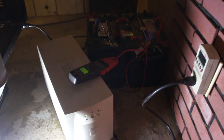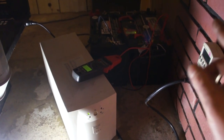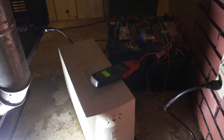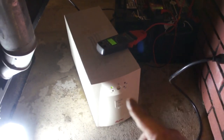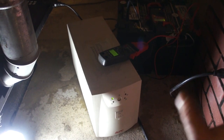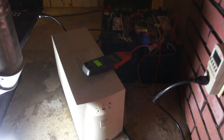That's inefficiency. The reason I like this UPS unit is it's efficient because there is no continuous conversion loss. Also, the battery charger would wear out under constant load, the batteries would be under constant strain from continuous discharging and recharging, and the inverter would always be under load — giving off heat and eventually failing. With this unit, it's just monitoring the incoming line voltage and only turning the inverter on when it's needed. So your batteries are happy, they're in a float scenario, and they'll last you 10 years or longer if you maintain them. Although the charger-plus-inverter approach would work in a pinch, this is a much more feasible long-term system.